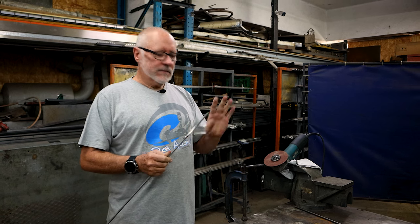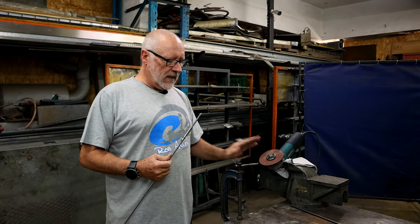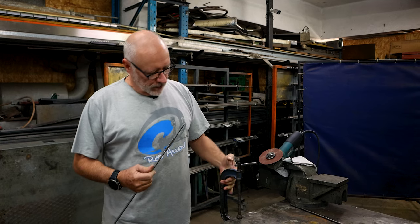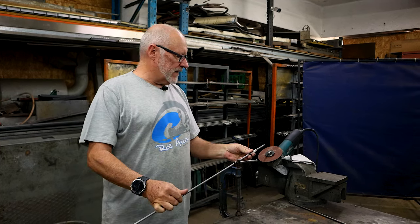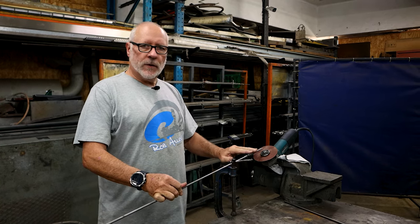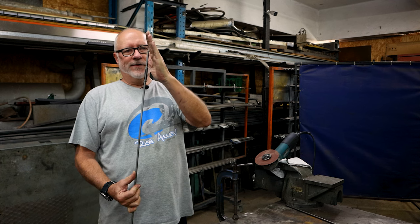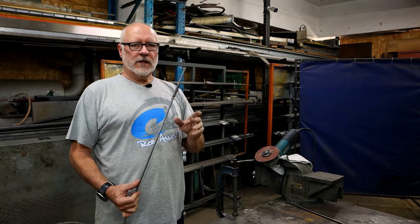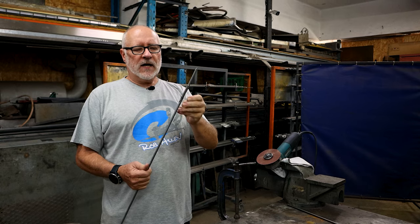The best is to set up like this — very simple. You need an angle grinder, you need a vice, you need a good g-clamp. It's all about getting the correct angle. In my case I've set it up so that the angle of the disc in relation to where it's being supported is roughly 60 degrees. You can go a little bit less or a little bit more — it's not an exact science. You stop the barb from getting in the way by taping it up.